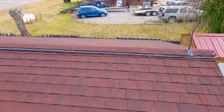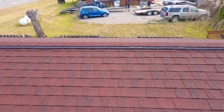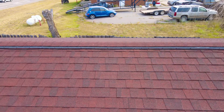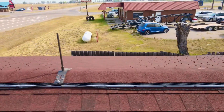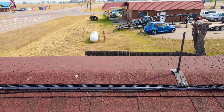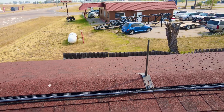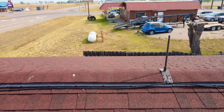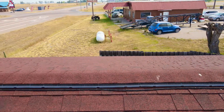The air terminals are within two feet of the outside edge of the roof. The lightning conductor in this case is tucked right along the underside of the ridge vent — that's the gray stripe there — and we follow that line for concealment. Air terminals are fastened to the ridge vent, very inconspicuous.